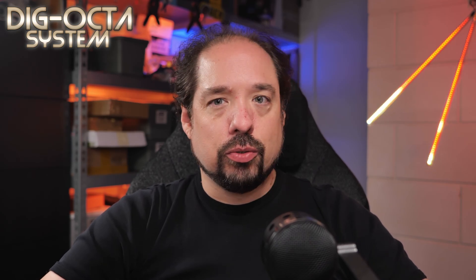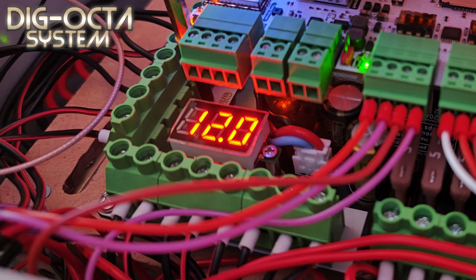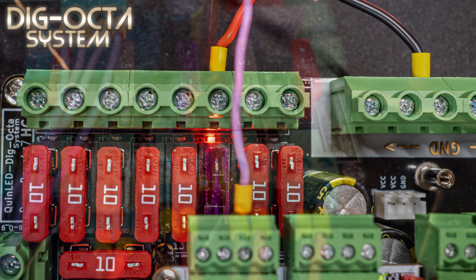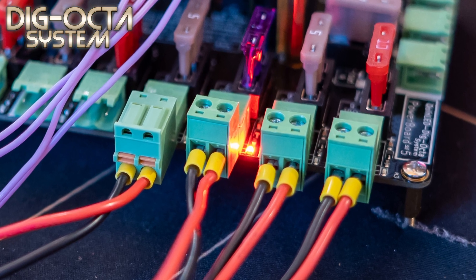All normal power boards are rated for up to 50 amps continuous and up to 100 amps continuous for the HC or high current versions. Another thing all power boards will get is a built-in voltage meter display. This can quickly show you what the current input voltage is — especially handy when you have a mixed voltage stack — but it can also help you visualize if you're having a lot of voltage drop and should increase wire size or identify a malfunctioning power supply. All power boards also have a broken fuse indicator light per output, which only engages if something is connected to that port. If a fuse does pop with an LED strip or string connected to it, it'll show a red light indicating which fuse popped.